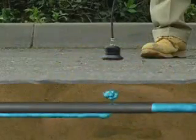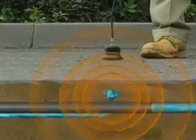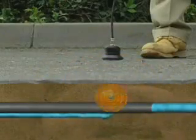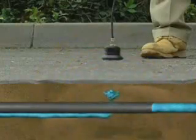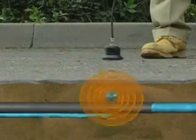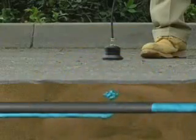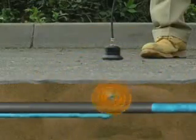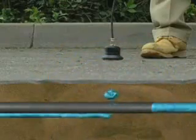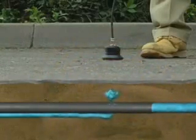First, let's start with the inside line on leaks. Leak sounds are created by three different situations. The vibration of the pipe caused by water forced through a crack in the pipe — this is the loudest and easiest leak to detect because it sounds like a whoosh or a hiss. Water forced through the crack and hitting the surrounding soil is quieter and is affected by the type of material around the pipe.